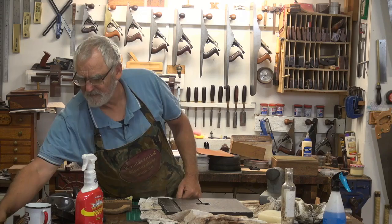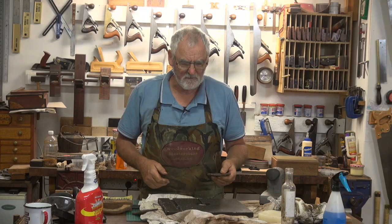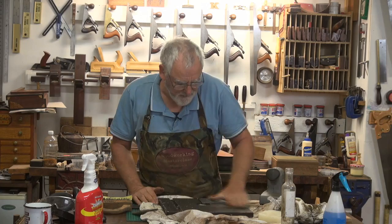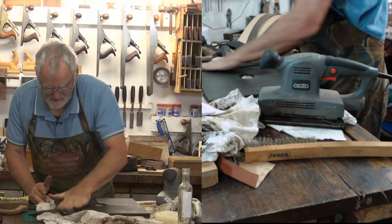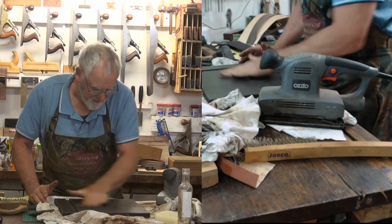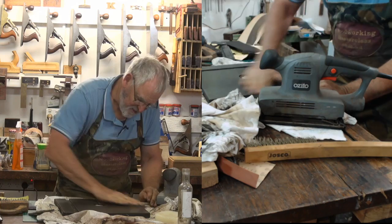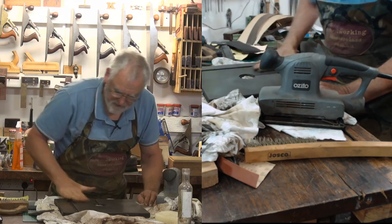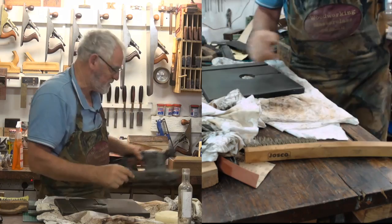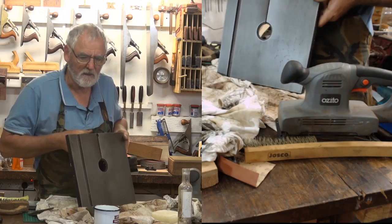All right, so I've just put candle wax on that. And this is just a Scotch-Brite scourer. By doing this, you're just putting a thin coat of wax over the table. Try not to have any big blotches there. And then it will weatherproof it a little bit and also allow the timber to slip. So if I put a bit of water on that, it should just bead. There you go. See if it runs off. There you go. Just runs off.